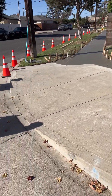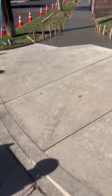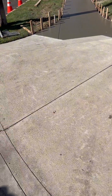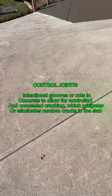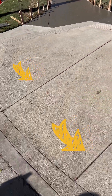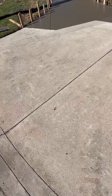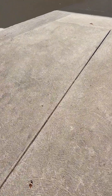We're on a job site where we had to remove and replace the sidewalk, but the city specifically said do not touch this ramp, so we left this ramp in place. I'm showing you this because it's a perfect illustration of why you have control joints in a sidewalk. When this ramp was poured, they put control joints here — those two lines cut into the concrete. They were hand-tooled as they poured the concrete.